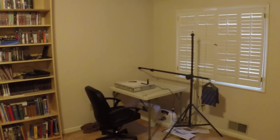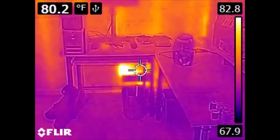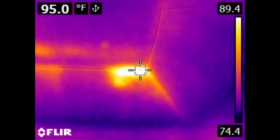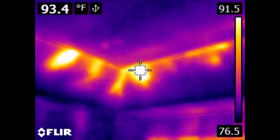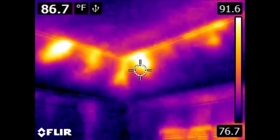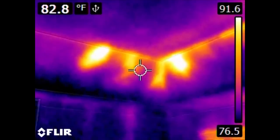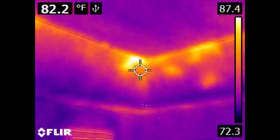Here in the master bedroom, we have an output vent on the wall and a return, which is quite hot. But the real takeaway from this room is up here — this room has a tray ceiling, and it is not uncommon for insulation put on top of a tray ceiling to slip off over time. Some of these spots are very hot. This might be addressed by going up into the ceiling, taking a look around, seeing if insulation has fallen off, or even if you have sufficient insulation. When this house was originally built, the attic spaces only had about 2 inches of fiberglass insulation in them. If you have a contractor come out to upgrade the insulation in these spaces, they will probably put around 2 feet or so.